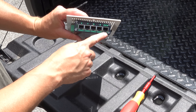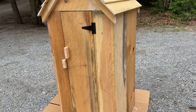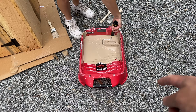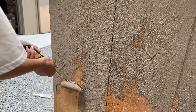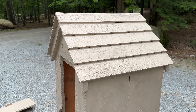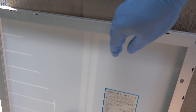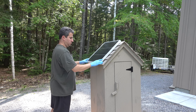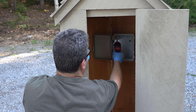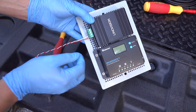I use the two larger screw holes to mount the pegboard right into the back of the box. I didn't want anything too high-tech looking, so I decided to hide all the equipment inside a tiny garden shed, and I enlisted some free labor to paint it to match my house and garage. Before bringing it down to the field, I did a dry fit starting with the solar panel. I put three screws in the roof to hold the panel in place securely enough for my area. I then mounted the box into the back of the cabinet. Note that some solar controllers put out quite a bit of heat, so I'm not planning to close the door — I'll just use it to shield any water that might find its way inside the shed.